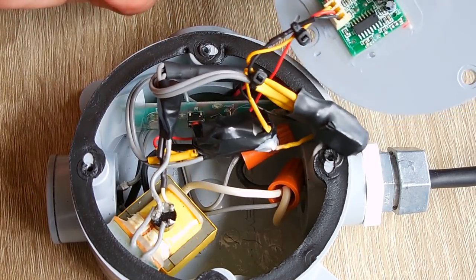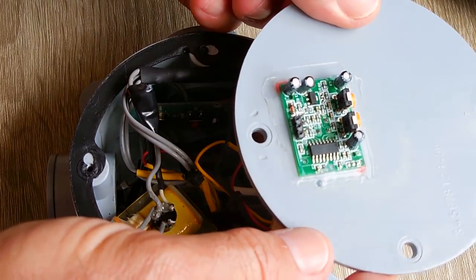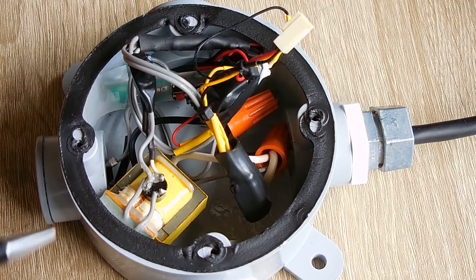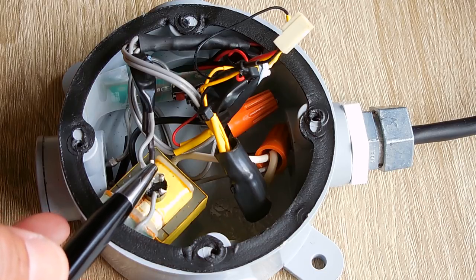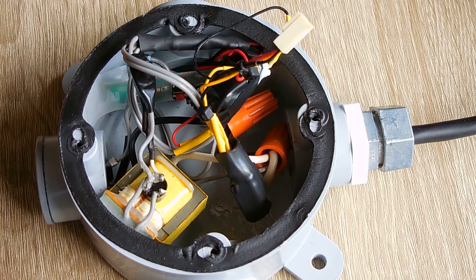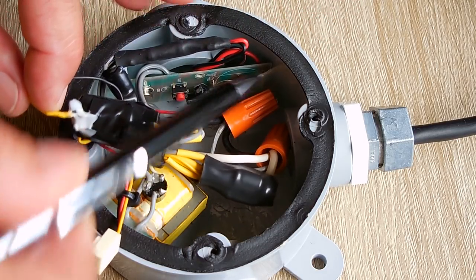Now over here is the back side of the PIR module. I can disconnect this by just using this connector that I used. Silicone all the way around the edges. With the PIR module and cover out of the way, right over here you can see the 120 volt step-down transformer. On top of it, using some silicone, I stuck on this full-wave bridge rectifier — it's a very small one, rated a half-amp or one amp. If you don't want to make one out of 1N4001 diodes, I'll place a link in the video description area where you can get a ready-made one. That DC output is then smoothed by a capacitor. Over here is the 5 volt reed relay along with the transistor, resistor — this is used to control the transmitter board for the wireless doorbell.